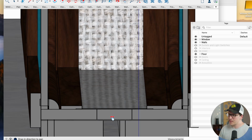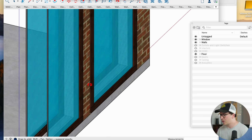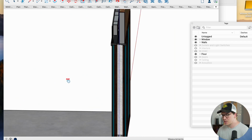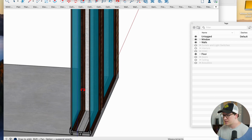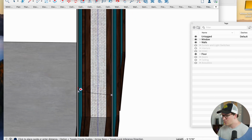And I like to put some desiccant packets down in there just in case there was a little bit of moisture when you install the window. Those desiccant packets will just soak it right up and you won't have any sort of moisture issues around your window at all. So both windows are built exactly the same. Beautiful, beautiful large windows that will stop really a lot of sound. These are super thick glass and we have dissimilar panes, and the massive air gap there is going to really help you.